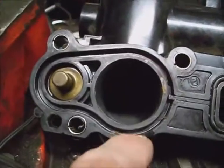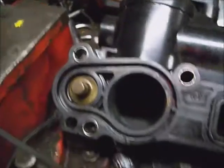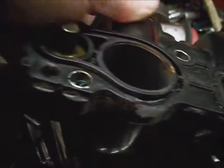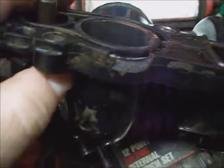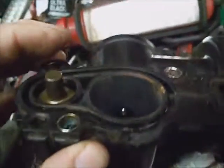This housing lasted ten months, and the one before it lasted about the same. When the seal gets too much pressure on it, it blows the seal — pushing so hard it dislodges it. This is the weakest point in the housing; the seal pops out and all the antifreeze runs out. So I'm going to vent the pressure, repair this spot, and send it on its way.